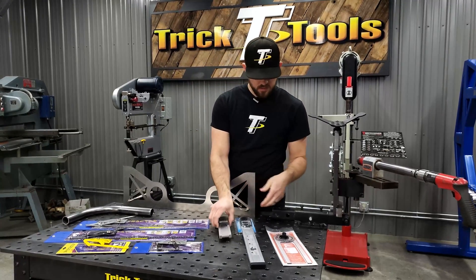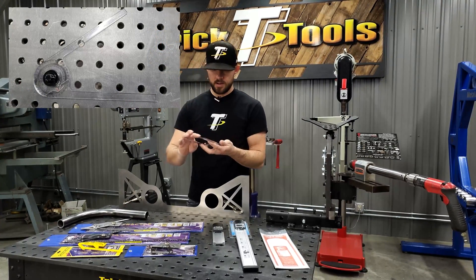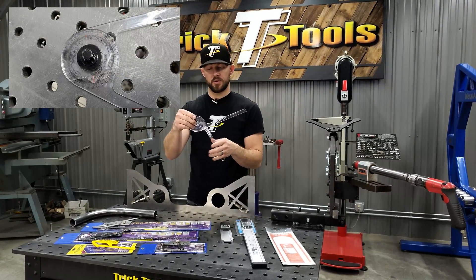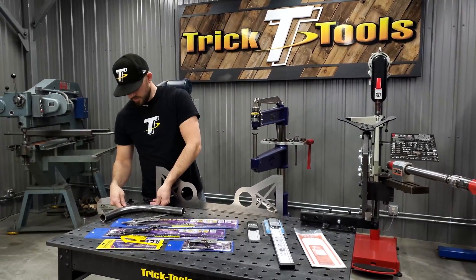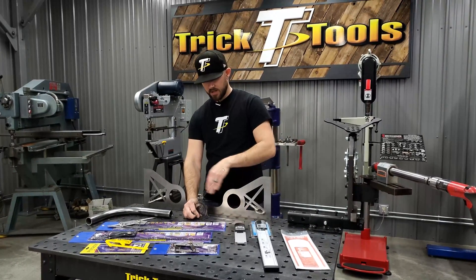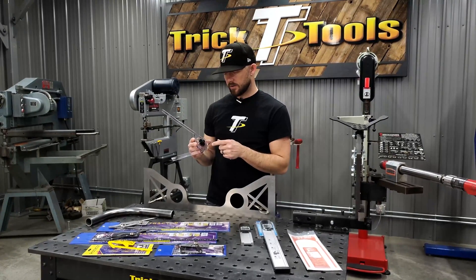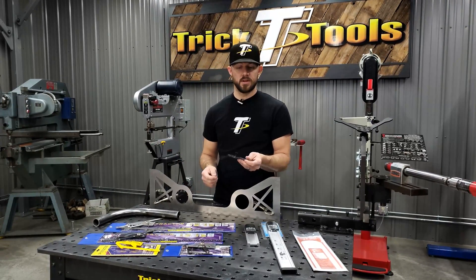The last angle finder protractor we have is this miter gauge here, which is clear plastic. It has a 360-degree dial on it and you can spin this a full 360 degrees — however you're trying to measure, whether it be the outside or the inside of an angle. Like if you're measuring on a tube you can measure outside, and you can also do the inside of a miter if you're trying to lay it on an edge. That's 360 degrees around on the dial, and it also has the miter angle number on here — once you get your angle set, you'll know what your miter cut needs to be. Tighten that knob in the middle and it holds it steady for you.